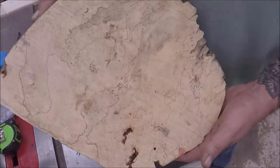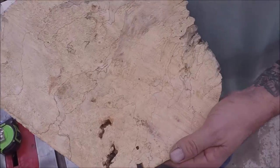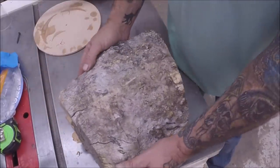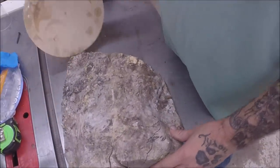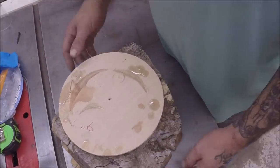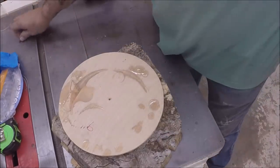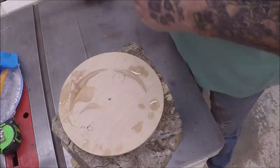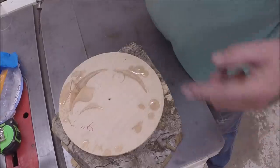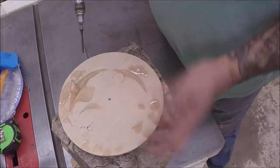This is a piece of that box elder burl — that spalted, punky burl. I'm going to try to make a bowl out of it. It's not real easy for me to turn; I'm not real proficient at sharpening my tools. I do want pieces of it missing. This is the bottom of my pressure pot, 9 inches, because my pot's cupped at the bottom. I'm just going to screw through this and run it around a band saw as a template, then face plate from the other side to shape this bowl.